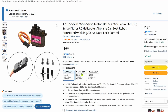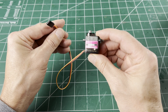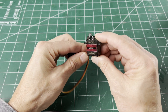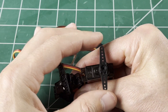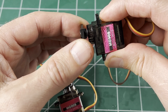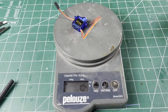For a slight step up in cost there are the MG90 servos. They have twice the torque of the SG90s and come with metal gears. These cast metal gears are far stronger than plastic but are not as strong and precise as machine gears. For under two bucks a pop they could be a lot of fun and add some durability without much cost. They are still analog but the dead band doesn't seem to be as bad as the plastic gear version. I had fewer dead-on-arrival problems with these MG90s, but loose gear tolerances make for some examples with too much slop, so some sorting might be necessary to find the better ones. At only two grams heavier and twice the torque of plastic-geared SG90s, they are pretty impressive for the price.